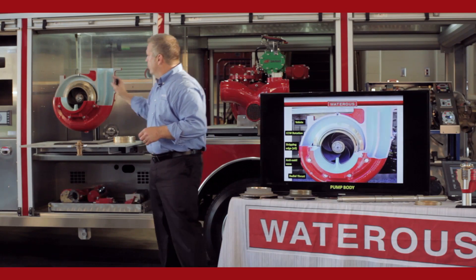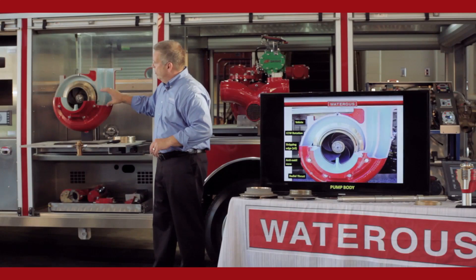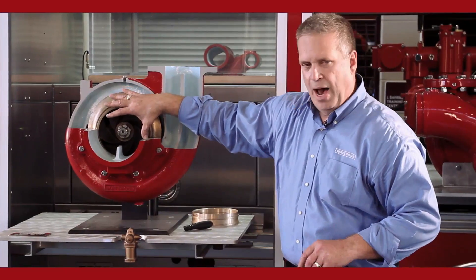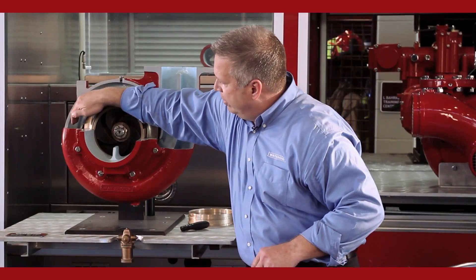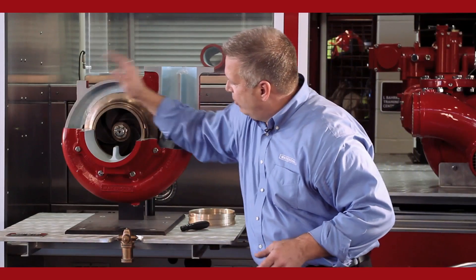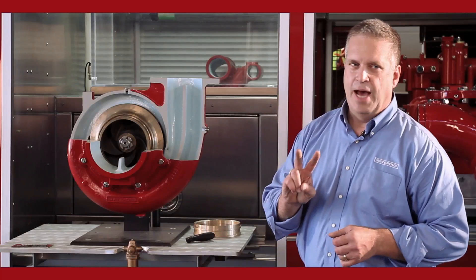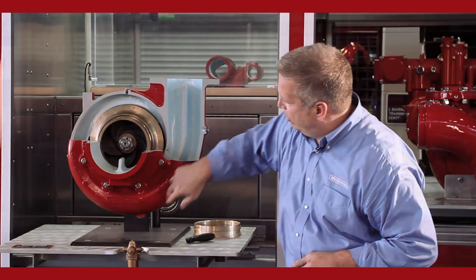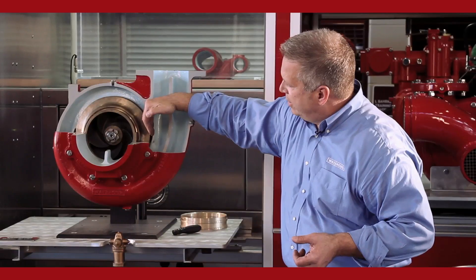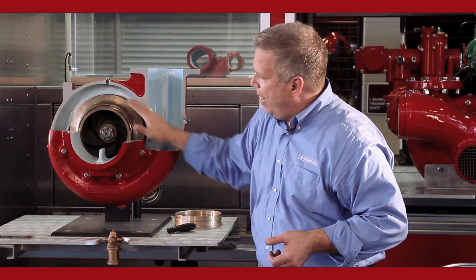Now let's go inside the pump. We're going to look at the S100 and the centrifugal impeller inside the pump body. A bronze impeller, just like we talked about before. We're going to direct the water from the intake side of the pump to the discharge. If you notice, the impeller doesn't sit in the middle of the body — it's pulled over to one side, closer on this side than the other. This area we're creating is called the volute of the pump — it's a pathway for the water to follow. This particular pump, the S100, has two volutes: a top volute and a bottom volute. The water always seeks the path of least resistance, or high pressure seeks low pressure. When we tuck the impeller tight to the side of the pump body, we create an area of high pressure. As it comes around going out to the end of the volute, it's lower pressure, so it's a pathway for that water to follow.